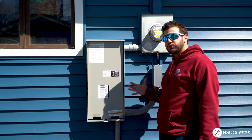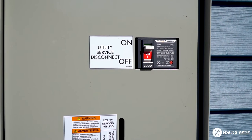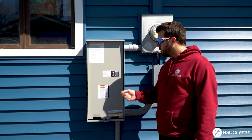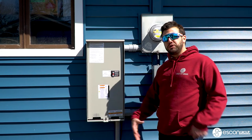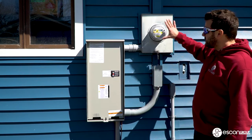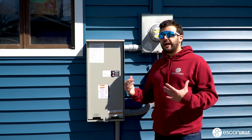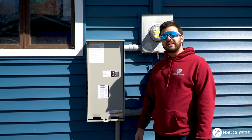This here is going to be the inside of the transfer switch — again, it is a 200-amp transfer switch. Up top you have your main utility service disconnect, on/off, very simple, very straightforward. Down here, this little slot — there's actually a little lever that Generac provides so you can go from utility power to generator power manually. This is an automatic transfer switch, so if you're out of town, not home, or laying in bed, when the power goes out, the sensors within the transfer switch sense voltage drop from the utility and automatically make that transfer over to generator power. But if it happens to get stuck or whatever the case may be, there is a spot to manually crank it down into generator power.